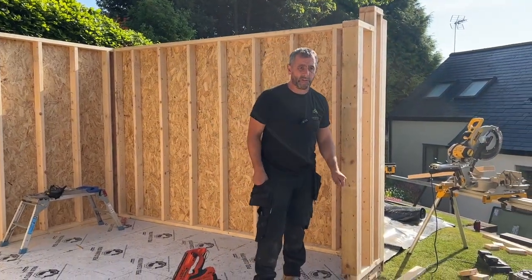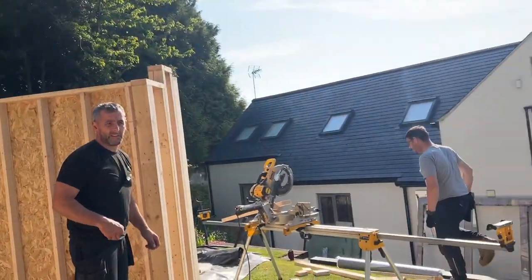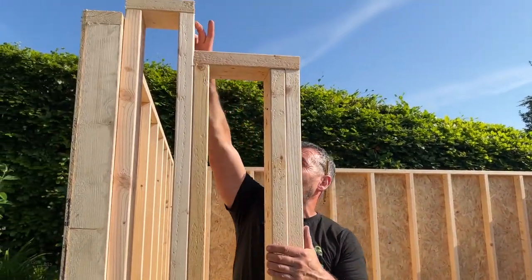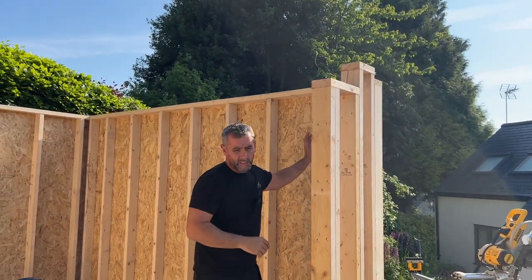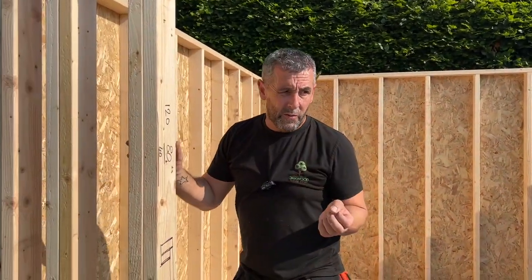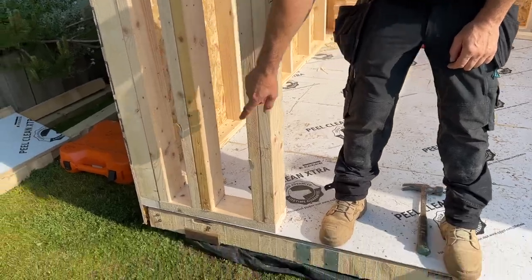John's going to find a string line now. We've got a double timber there, the steel will sit on there, and that distance is 160mm. The distance between the walls is yet to be confirmed — we need to plumb them first. Once the walls are plumb we'll fix them together, then that distance will give us our steel span. We'll knock off a couple of millimetres to make sure it actually goes in.